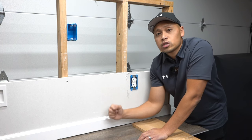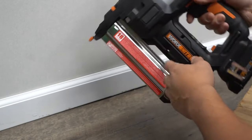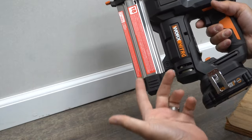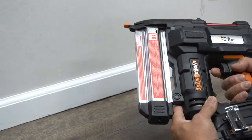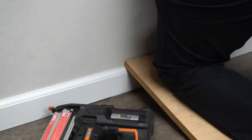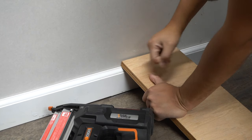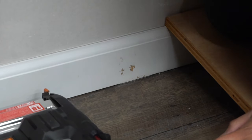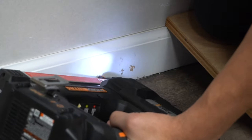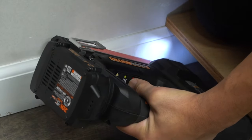With that being said, let's go try and push this down. I would get your brad nailer ready. This is 18 gauge brad nails that I'll be using. I'll be using my Nail Force Work Nitro. All the tools that I use within this video, if you're interested, I'll leave all the links in the description down below, including this tool right here. As you're applying weight on the top, notice how the baseboard is already starting to go down. So we're going to apply a little bit of weight here. Just take your brad nailer and just shoot a nail. Just like that.